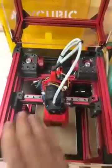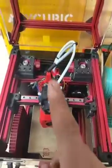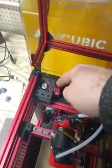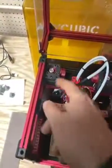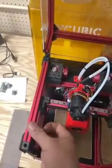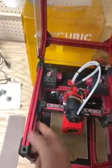If you have it with the belts on, you have belt-induced racking, which happens basically from tightening one all the way up, and then you tighten the other one. So what a lot of people did, when I did initially, is I'd tighten one up and go ding, ding, ding, till the app or whatever said it was 110 hertz or 115, whatever it is. And then I switch over to the other one.